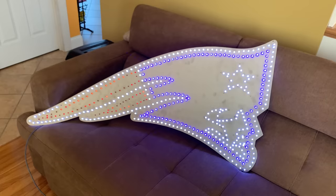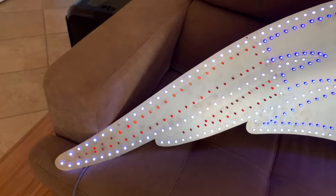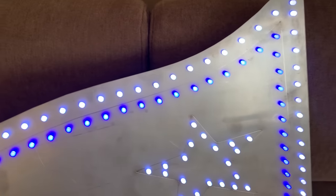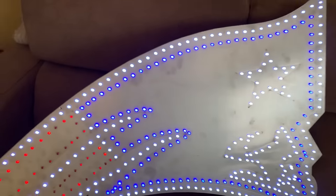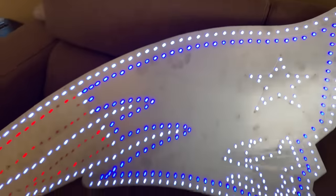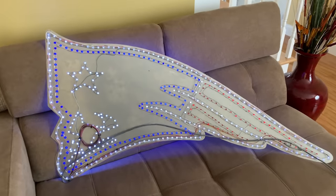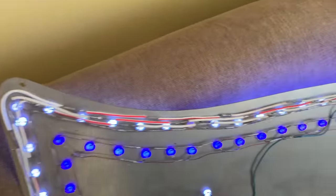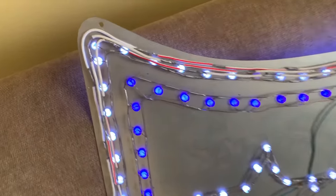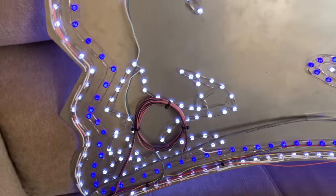Let's take a tour of the components and how it works. The actual sign is made on stainless steel — I had it laser cut, with each individual hole for the LEDs. I designed it in CAD software and exported it as a DXF file. The LEDs were manually put into each slot and pushed in from the back. On the back, we have all the LEDs run — on the border side, every three LEDs is connected to give that cool effect. All the blue LEDs are connected, held in by friction only with no hot glue.